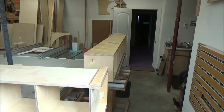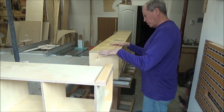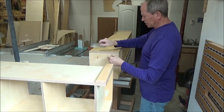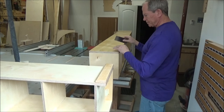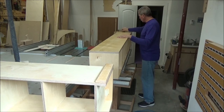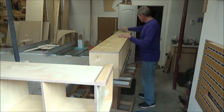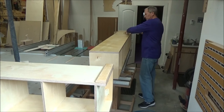The other one — I had some drips from the top that rolled over this corner, and I had to get my scraper up to knock those down. And then I thought, why don't I just scrape the finish instead of sanding it? The difference is I can really get into these corners, then just pull out, and you can hear and feel the roughness. When I go back the second time, it feels just as smooth.